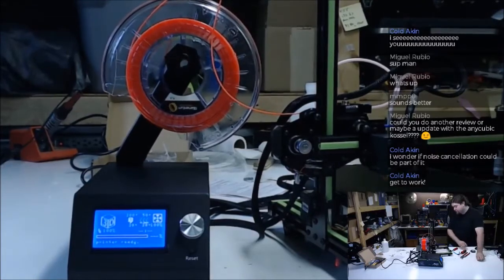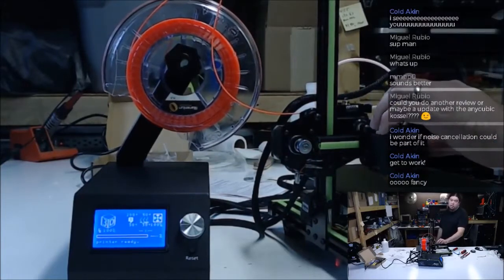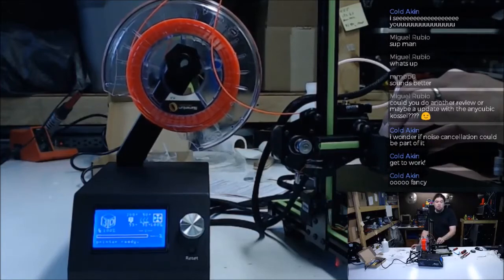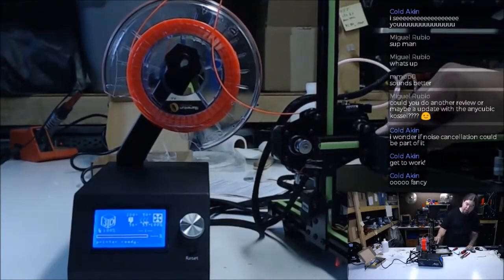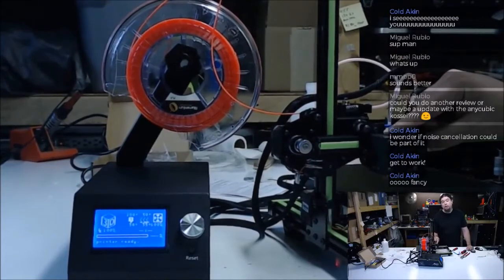They're both increasing again. That is good. The part fan is on. That's why. That's why it's cooling so slowly, is because the part fan is on already. And that is because, my guess, is because when you preheat for PLA, it defaults to part fan on.